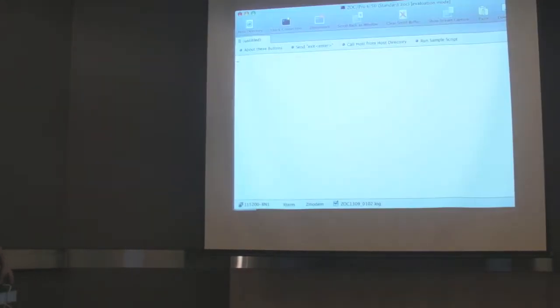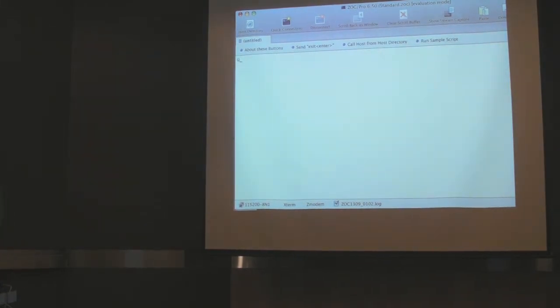Zoc. It's an amazing thing. It's called the Zoc. It doesn't like it, does it? It's your baud rate, right? Baud rate must be correct. 115200, 8N1. I tell you what. Shut this down, unplug the USB device, replug the USB device, and then restart.